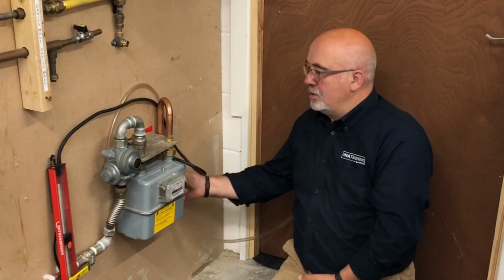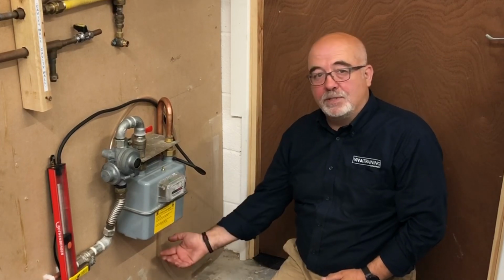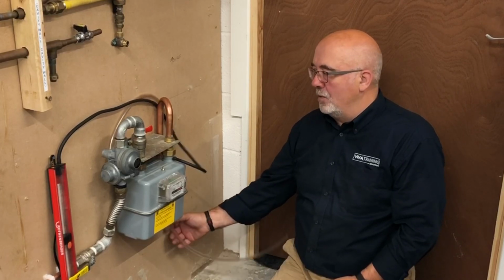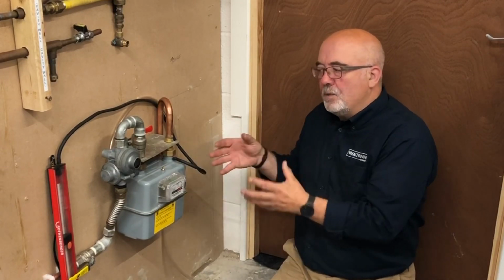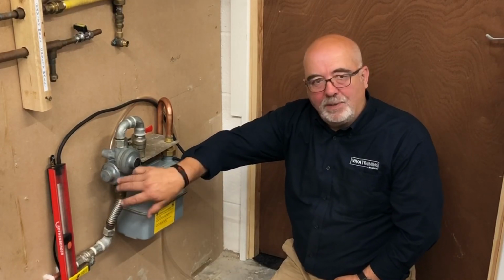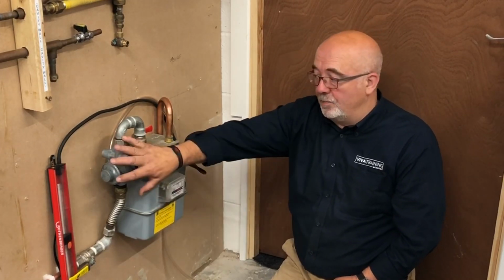And you said about that clear tube. What's that tube for? And did you say 25mm? Yeah, this tube would normally run inside the meter box, comes out pretty much adjacent to where the pipe comes out at the bottom, should stick out at least 25mm, mainly because you don't want any chance of the gas accumulating in the box. People have asked me, what do you mean the gas? If there was a problem with overpressure, this is an overpressure release valve built into the actual regulator that converts the medium pressure to low pressure.